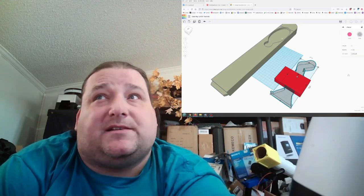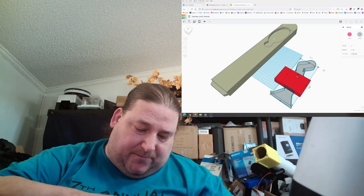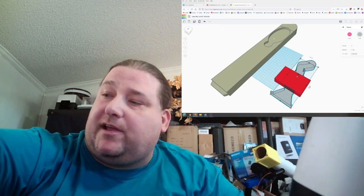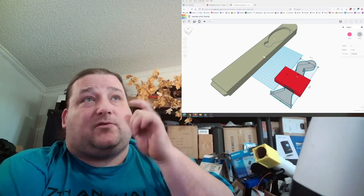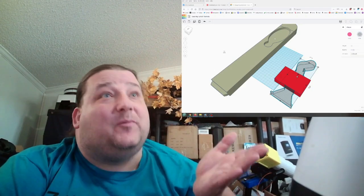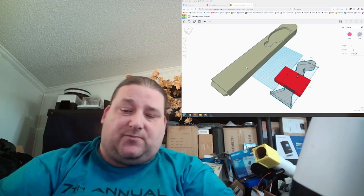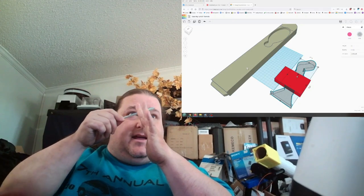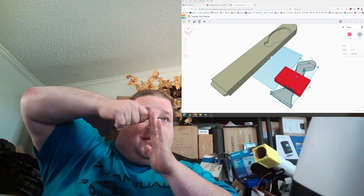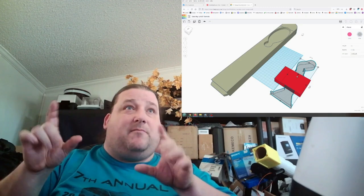This part here is a reinforcement. I have this little brass-colored steel tag — a tiny metal tag that's 7.5 millimeters wide, that's why I bought it. When I'm done printing, I'll glue that little tag right into it. When you stick the key into the keyway, that little metal tag will be half inside and half outside of the keyway, so when you torque the key the metal tag absorbs the torque instead of the plastic key absorbing it.